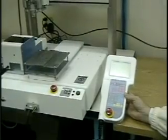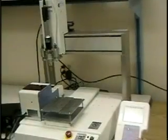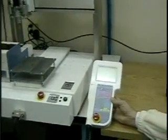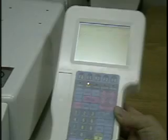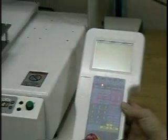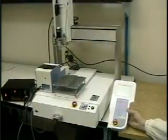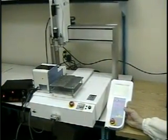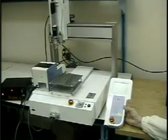The final element is the robot, which uses software designed for screw fastening. Data can be entered via the remote teaching pendant or PC software for programming all the required parameters. Teaching the robot to fasten is as simple as positioning the robot over the opening where the screw is to be fastened and creating a set of screw fastening conditions, which consist of screw length, screw pitch, RPM, and screw fastening accuracy.